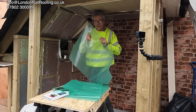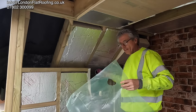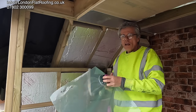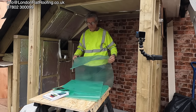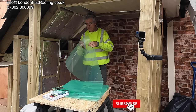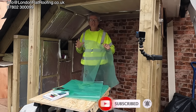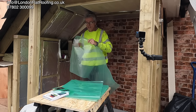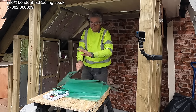I've purposely put a hole in it because what I see is people put up a vapour barrier, then go and get a light fitting and stick it through the vapour barrier. And you've got all this moisture going through. It doesn't matter what the quality of the vapour barrier is if you've got holes in it and moisture is just transferring directly through the hole. It is all this 'must get the right vapour barrier' — but if you're not using and fixing it correctly and sealing all these holes, it's just not going to work.